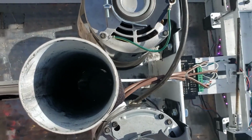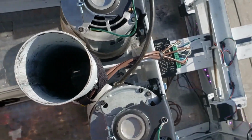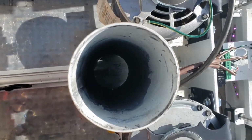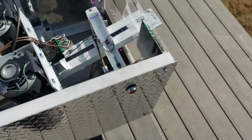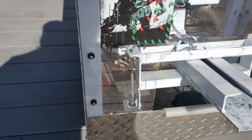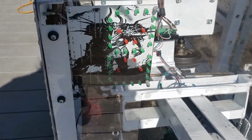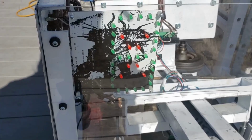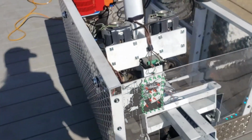When the machine fires the last puck it has in the holding tube, the photo sensors and the LED built into the tube will let the user know that there is no more pucks when it goes into puck check mode by flashing this X on this custom 7-segment display to allow the goalie and net to realize that the machine is empty and needs to be refilled.